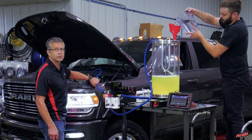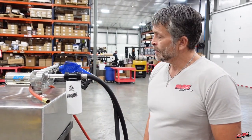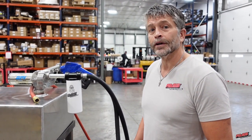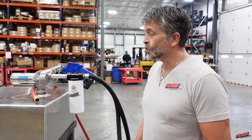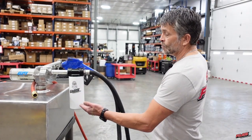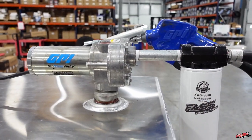We take out 99.96% of the water, wanting to ensure that you're getting healthy fuel out of the tank. Here you go — our fast transfer tank filter. No one is going to beat this one for taking water out. When this filter reaches its capacity of water, it's not going to bypass — it's going to shut it down and not deliver.